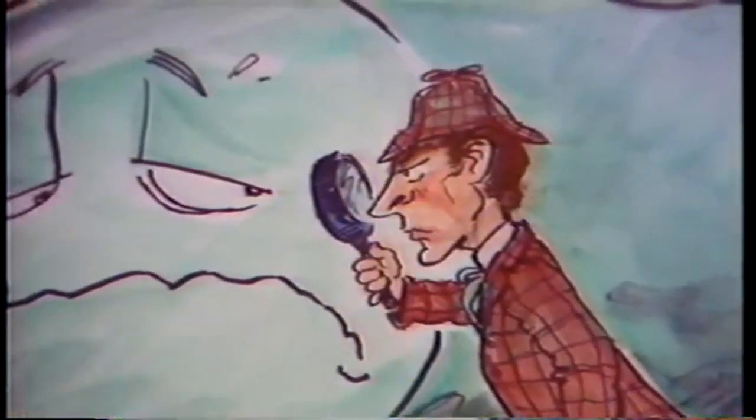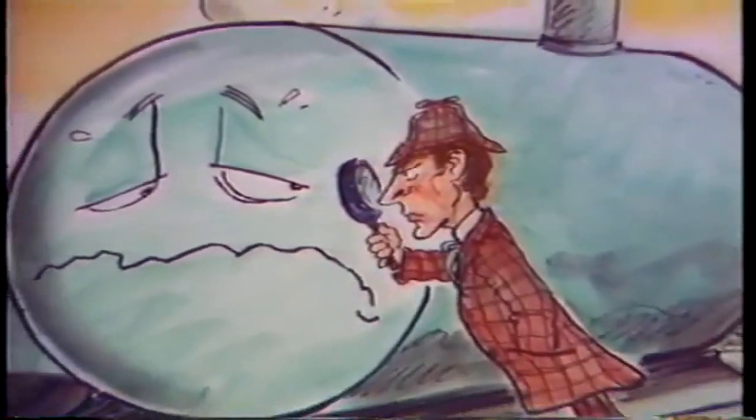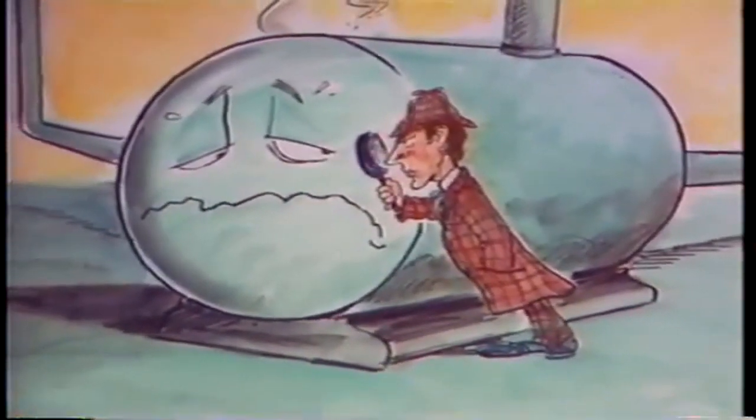Once the heat exchanger is cleaned out, a thorough and careful inspection is in order to find any leaks that exist. While the system was running, there may have been no evidence of leakage problems. Regardless, it's really important to make your inspection as thorough as possible. The more careful you make your inspection, the less likely it is that a problem will crop up before the next scheduled maintenance. A number of things go into this detailed inspection.